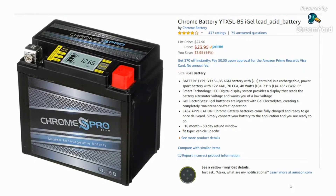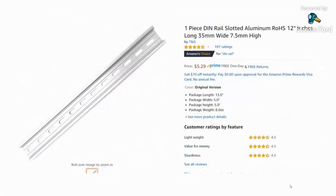You need a good battery. I chose a really small lead acid battery — this one is $23, it's really inexpensive. You can push the button on the top and check the voltage level. You don't need a huge battery because you're going to be recharging it every day with the solar panel. I also use a DIN slotted rail as a mounting bracket for the timers and the circuit breaker — it makes for a nice clean installation.